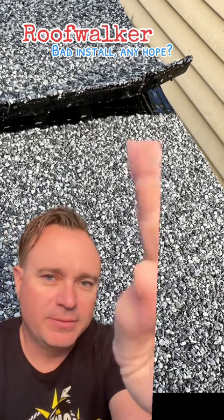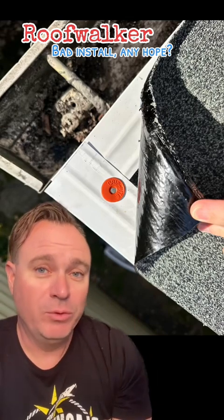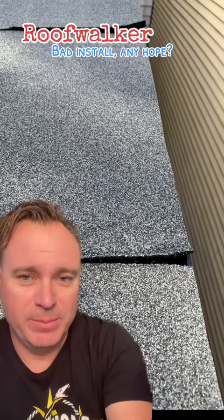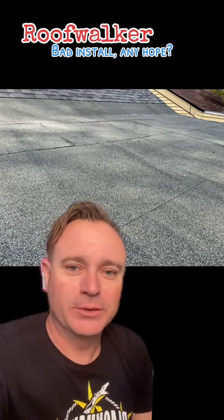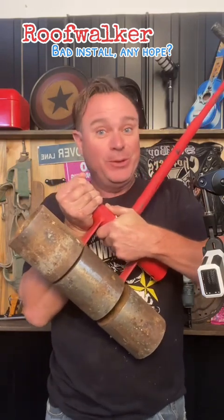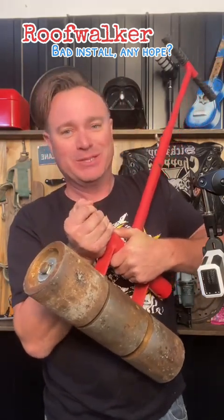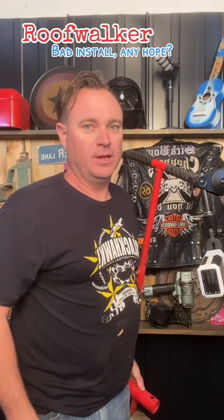You have things like this going on. I don't know what part of the country you're in, but I'm assuming it's not real warm, especially since it looks like you might be wearing a jacket. Look at all these bubbles and wrinkles — they skipped this thing. When you're putting that peel and stick down, you're supposed to use one of these so you don't get all those bubbles. A pneumatic nailer, a knife, an 80-pound roller — things a man can use.